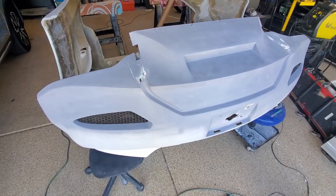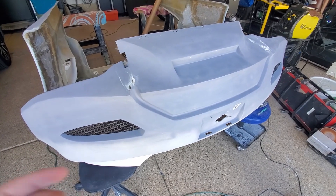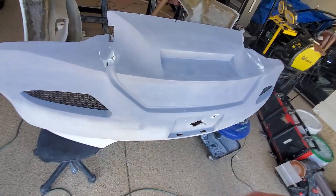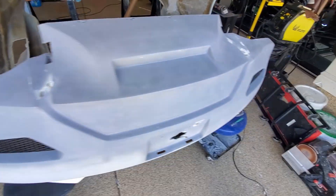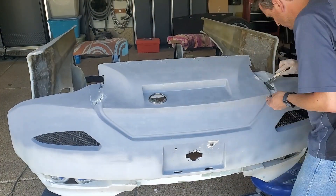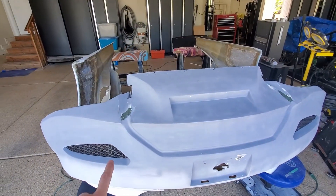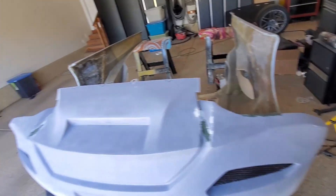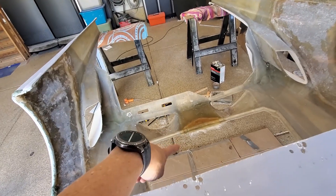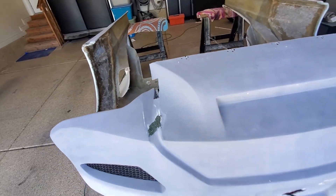One potential advantage of taking the shell on and off so many times is we stress it a lot — picking it up, bending it, twisting it, flipping it over — and I found a couple of cracks on the joints that I made. I widened the cracks and filled them in with short-strand fiberglass filler in a couple places. I also climbed underneath and put it in between the seams, so I'll let that cure up and start sanding and making it smooth.